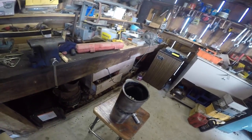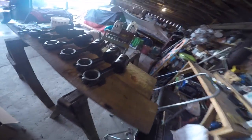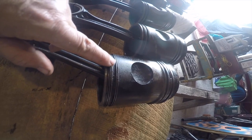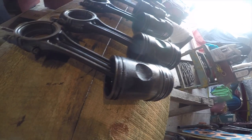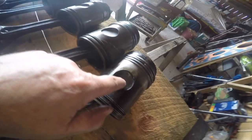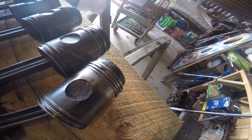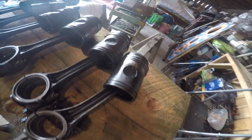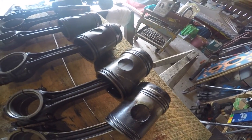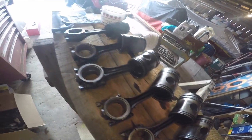Then it'll come back up and fire again every time it comes up. These are the pistons and you can see they've got rings on the bottom of the skirt and on top too — they really don't even have a skirt, it's just a big old piston. They've got plugs right here, so when it's coming down if that plug went in there it won't work right. I had one come off one time and it smoked to high heaven.